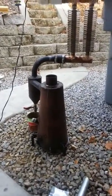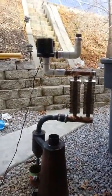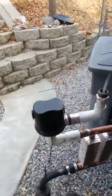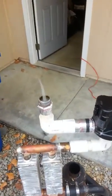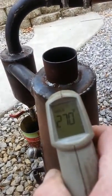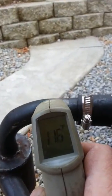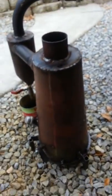This will hopefully be my simplified version of it. Here's the burner. My cyclone's on the side with a can underneath. I got a cooler going up, a small very slow velocity fan. You really can't see the flame but you can see the vapor on it. This is the simplified version I've made. It takes about four volts of electricity to run the fan. My chips are almost down to the bottom of the tube. The lowest temperature I've gotten is 270 degrees, then 260, 240. In the cyclone it's about 126 in the tube, about 120, 80 there, and about 50 roughly there. But it burns well. Runs the motor. Very simple.